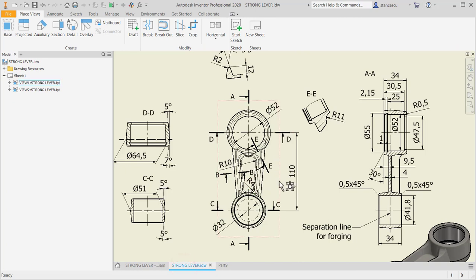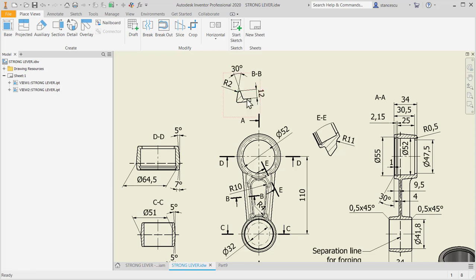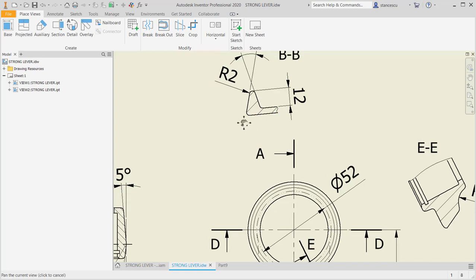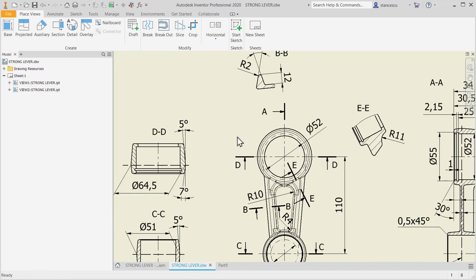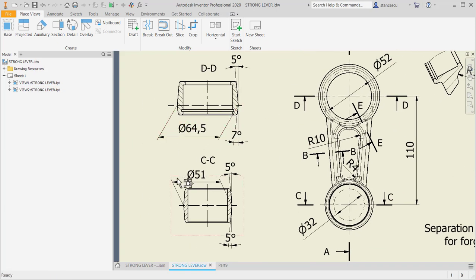Then we have to go up to obtain these two ribs, how can I call them, both being at 30 degrees. Yes, here is a round part, this is 4 millimeters, which we already gained, and this is the profile. We are now at this level, yes, with our construction. Let's go up. We have to create this contour, which is in respect of these two diameters.